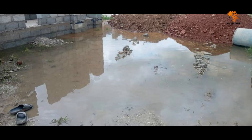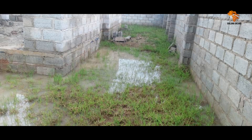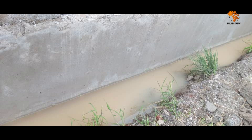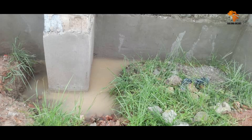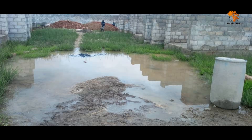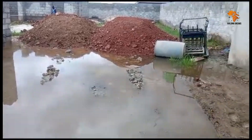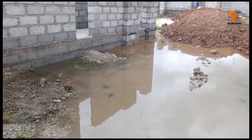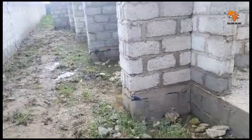Installation details and practical tips: there are a few critical things to keep in mind when installing a French drain. First, the trench needs to be deep enough — about 600mm to one meter — to collect enough water without getting overwhelmed during heavy rains. Second, the pipe should have a slight slope of about one to two percent; we're using a spirit level to check that the pipe slopes correctly. The outlet will direct the water to a safe drainage point far from the buildings. Once the pipe is in place, we cover it with more gravel and then backfill the trench with topsoil. This ensures the system is both functional and discreet — you won't even know it's there.